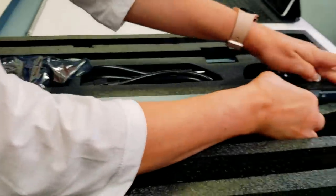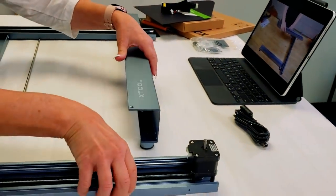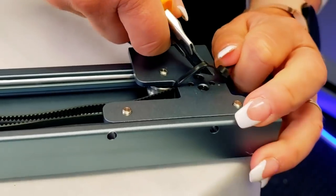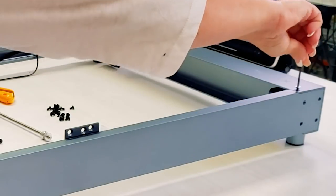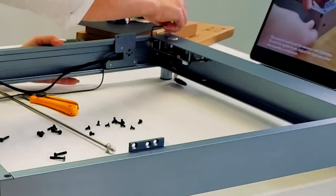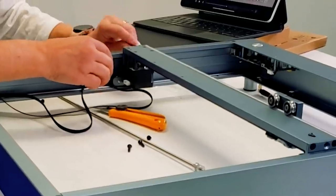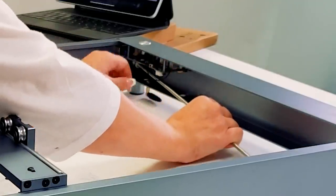The X-Tool is a diode laser, not a CO2 laser like the Glowforge. The difference is that a diode laser uses a crystal to create a beam, whereas a CO2 laser uses a laser tube filled with gas and electricity. Because it's only using a crystal, the diode laser is smaller and more portable, takes up much less space, and you can pick it up and set it on things. The CO2 laser is much bigger, more stationary, and you have to be very careful not to damage that laser tube.